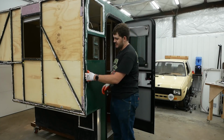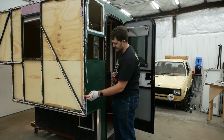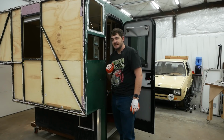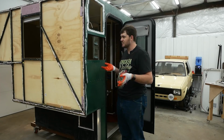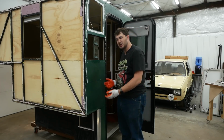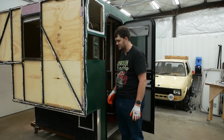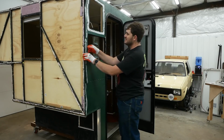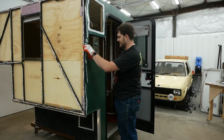My choice of cladding on the back, initially it was also that horrible looking corrugated plastic stuff, but it changed later on to this, which is PVC coated aluminum trim coil. It's not terrible and it was waterproof enough, but it just doesn't look good because it's all wrinkly. It's way too thin to be used for this sort of application unless I had a way to stretch it out before I installed it, which I didn't. So it just didn't look very good. Also, apparently I riveted it in place, so that's annoying.